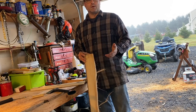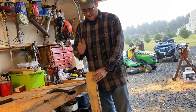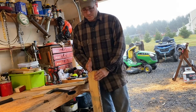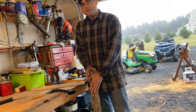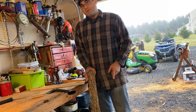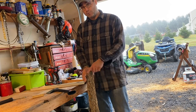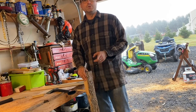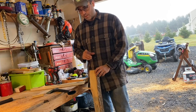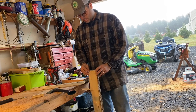I'm sure you could use white oak and other species of oaks as well, just as long as it's got a straight grain and it's easy to work. So once we have the sapwood, we can't use anything but hardwood. Bark has to be on it because what's going to happen is the outside of the bend of the bow is going to include the bark, and that protects the wood from splitting. We'll show you two examples of that — one that has bark on it and one that doesn't.